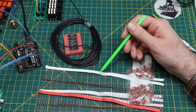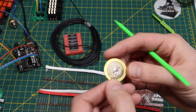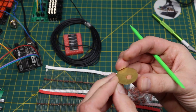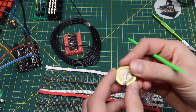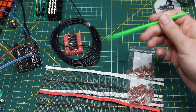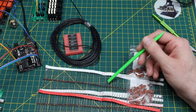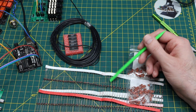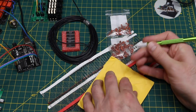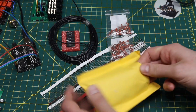Maybe I was trying to do some sort of signal clipping or clamping. For example, if I have a transducer like this old decomposing thing I must have taken out of something, and I want to hit it to generate input trigger signals on a microcontroller, I can use these diodes to clamp the voltage to suit the microcontroller's voltage so I don't send 20 or 80 volts into it.